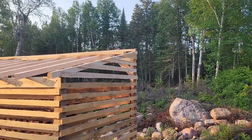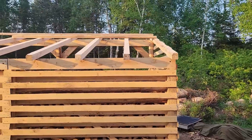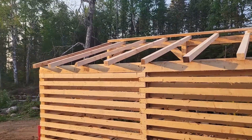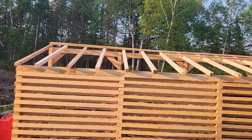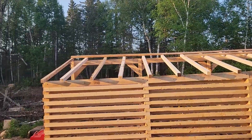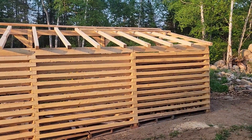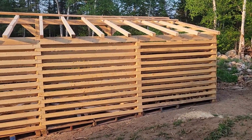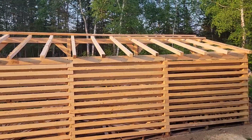As you can see, I've got the side done here — at least the outside edge. I've still got to do the inside of that bay. I've got all the 3x3s up on the roof, and I started to put my stringers up. I'll have to mill some more of these, but that's okay. I'll be able to get probably 3, maybe 4 rows done. I think it's 5 rows total with the mast if I remember right. That should really strengthen it up for the steel, so we should be good.